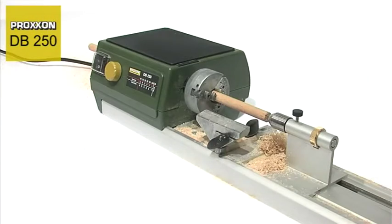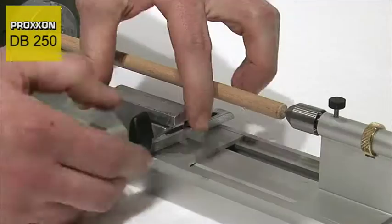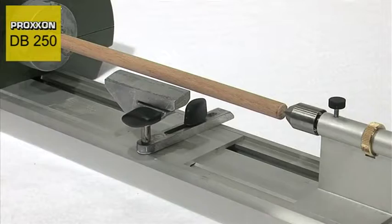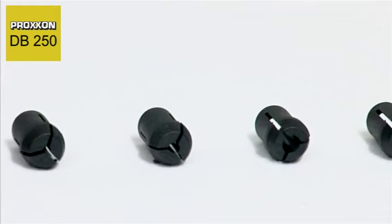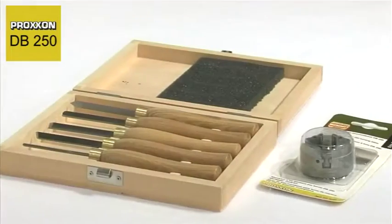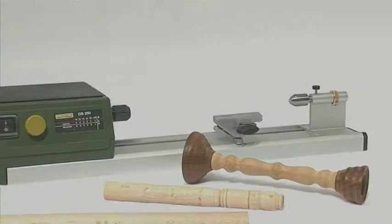The lathe is also equipped with a universally adjustable, stable chiseling support, a serrated carrier and a live center. A faceplate is also included for larger workpieces. A set of 6 collets is also provided. Every wish is catered for, with a comprehensive range of accessories including a set of chisels, a drill chuck for mounting in the tailstock and a variety of chuck jaws.